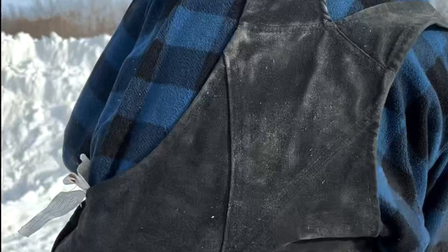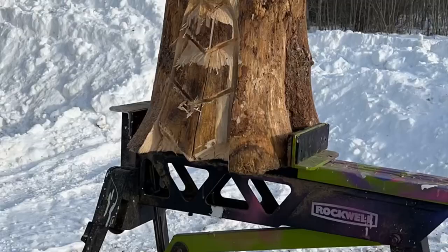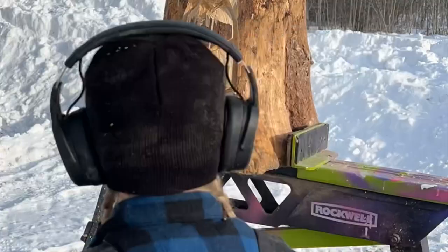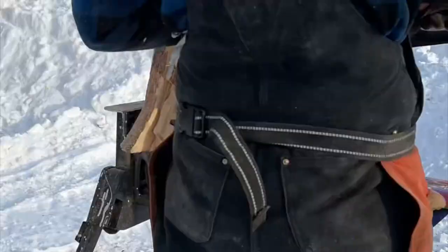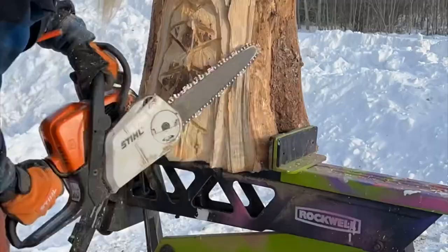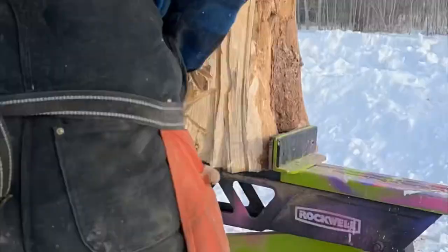You want to remove any excess material in the middle of the raccoon's face. Angle cut with the chainsaw to shape the raccoon faces to give them some depth. The ears and eye sockets will also be cut deeper inwards to appear further away from you. Avoid cutting the tips of the nose and the snout because we want those to stay furthest forward.